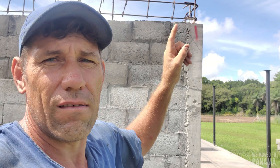And then on the side of the house, wherever I made a little line, like example, where there's a wall, when we do the extension, like there, let me get it there. There have to be two pieces of rods coming out. There's certain points of the building all along, and then that will also join up with the build on. Continue with your line to the wall you build, and then every second or third block, we put a number 4 bar drilling into the concrete over there and strengthen the whole frame together and make it as strong as possible.